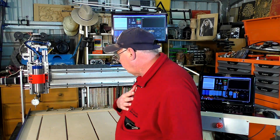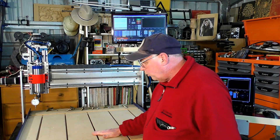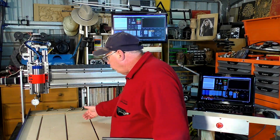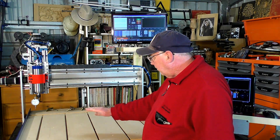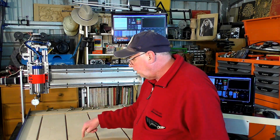What I personally use, in conjunction with that DTI gauge, is a granite slab. I acquired a couple of granite slabs some years ago, and they've come in very useful. They are extremely flat — that's why people use them. I'm going to get the granite slab on here, and using the same sort of technique as probing, I'm going to get that perfectly flat on here, just by putting shim material under it in certain areas. Using exactly the same process as probing the bed.